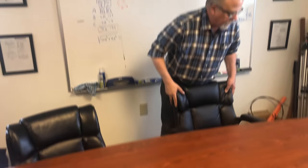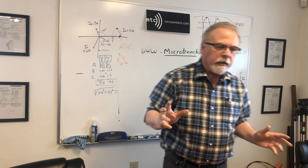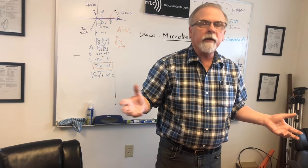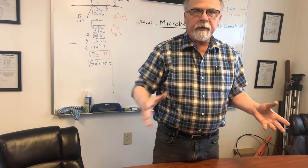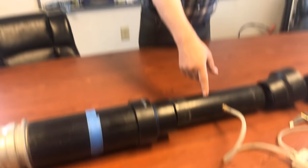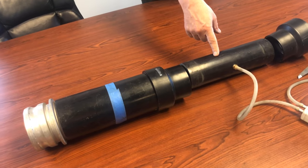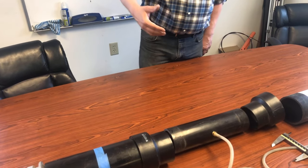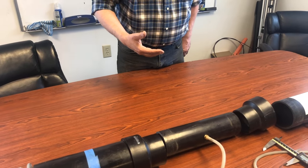Hi folks, Chuck McCown here. There's been some renewed interest in testing your Vac-X and seeing if your blower is shot. How much suction do you have? Or really, how many cubic feet per minute are you moving? Because cubic feet per minute translate directly into the velocity of an airstream in a pipe, and that's what you need — velocity to push the dirt out. The dirt could hit terminal velocity at some point if you really have enough air movement and lift.